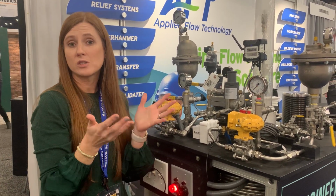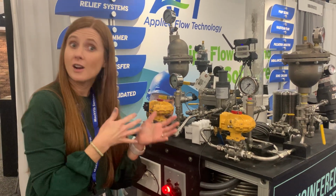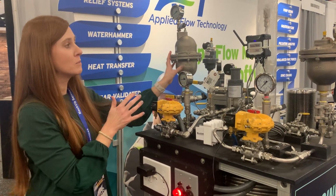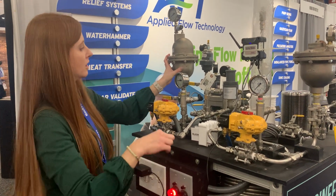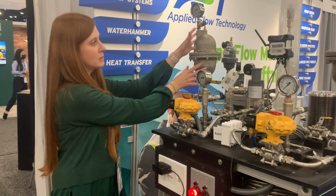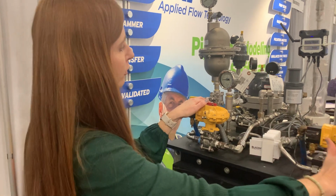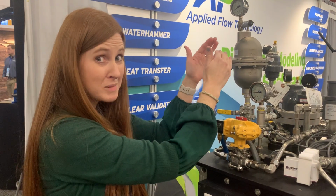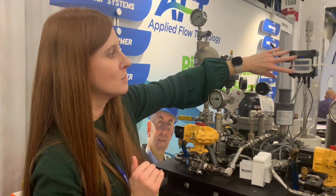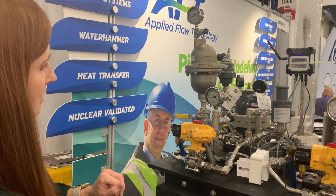The problem is that was a low pressure event, and you can't properly mitigate a low pressure event by solving for high pressure. In this case, you need a BLACOH surge vessel to give energy into the system so that you don't develop that vacuum pocket. So what you're going to see here, I have the BLACOH surge vessel off, and I'm going to shut this valve. My fluid's going to continue moving forward, and you're going to see this go to a negative pressure. You'll see it drop dramatically on the gauge, and if you look at the cloud-based data from the transient monitoring system, it will show you that the pressure is dropping to minus 10 psi. So let's see that.